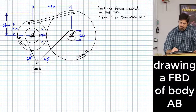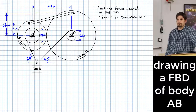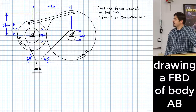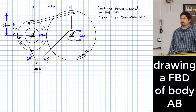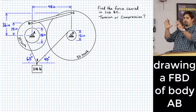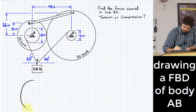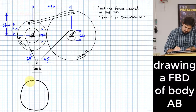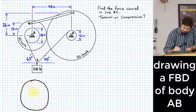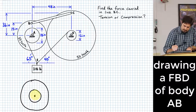Why are those helpful? That's the tension that's going to be in those two ropes that go up and wind around the two drums, both at A and at D. So how do I use those? What's my next thing to do? More free body diagrams — of what? We could do the two gear assemblies, each having a gear and a drum. So let's draw the 30-tooth gear with its drum and pivot point.